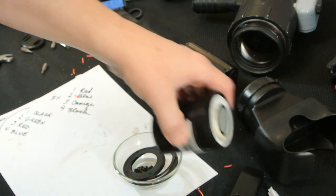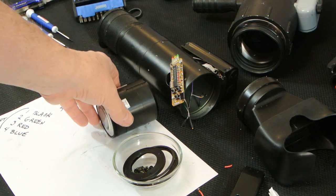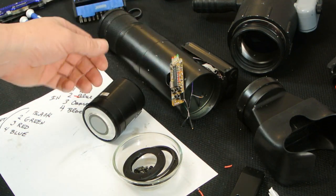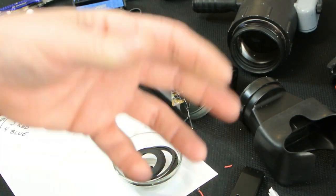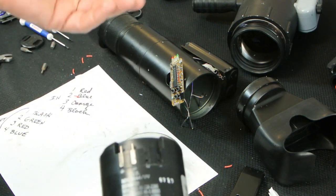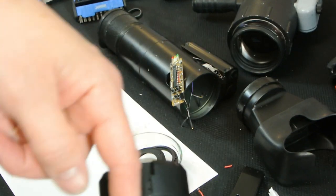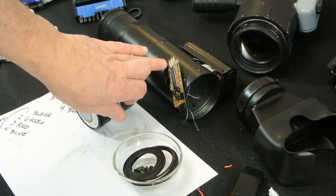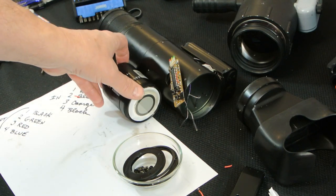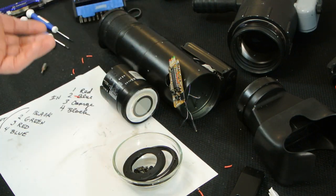Because the performance on this was lower than my other Gen 2 MX-9644 tubes, what I decided to do first was take it apart. In the past I'd never pulled this tube out — I just looked at it and said, yeah, 9644 or commercial something like it. Last night I actually pulled the tube all the way out, took it apart, disassembled this thing further, and got all the markings. I tweaked on the little pot down there — didn't get anywhere. Then I thought, okay, maybe it's the way they implemented this — they limited its performance for longevity or who knows what.